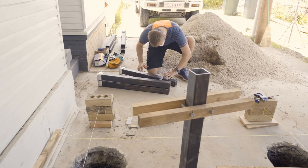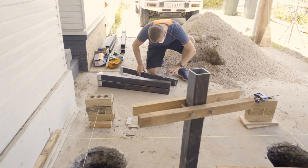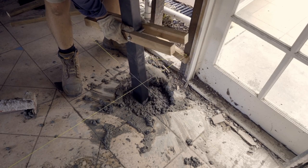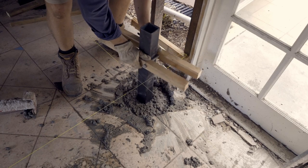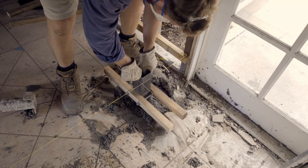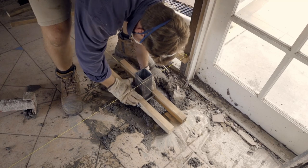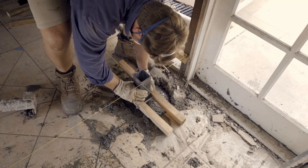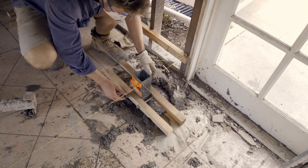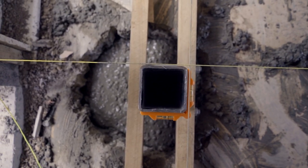Will is just marking up the points where we want the ground level to be. You can see in the foreground there's a little timber piece — a mounting plate on the other side of the steel post. That allows us to sit the post flush to the ground and supports it so we can make sure it's square and level so it doesn't jiggle or move at all. And that's just a little post level so I can check that I'm level and plumb all the way around.